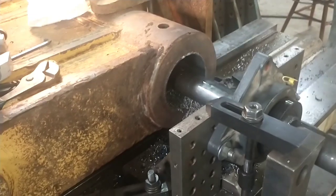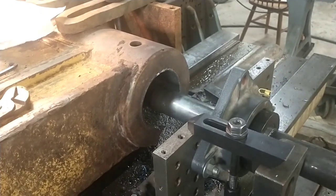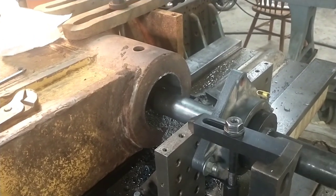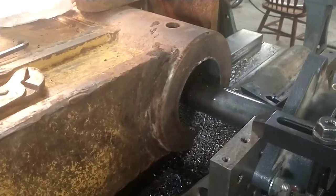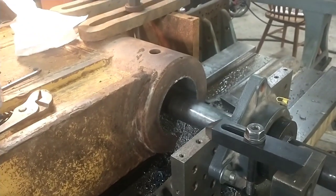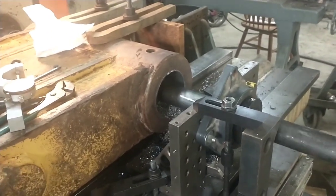We're on the finish pass on this side. There are a couple of voids in there where it didn't quite clean up, but they're small enough that we're going to ignore them. We're at about 99% surface contact, and at that point it's not worth fighting with those little cavities — you can't even see them from this angle because they're up around the top side of the bore. We're about three-quarters of an inch from the bottom of this bore and then we are ready to yank this thing out of here, press some new bushings in, and get her out of here.